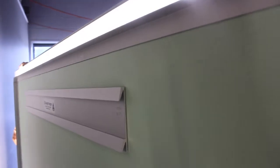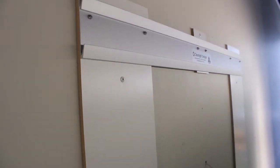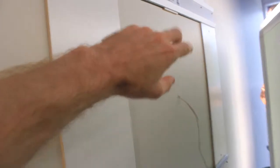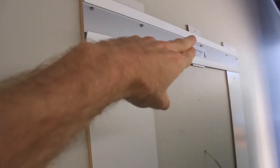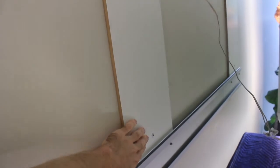This is what it looks like on the inside of the mirror. You've got your split battens — one at the top and one at the bottom — corresponding to split battens on the wall, one at the bottom and one at the top. The split battens on the mirror lock into place over the split battens on the wall. On the test wall here you'd normally have tiles; you just drill through the tiles and add the appropriate wall plugs with screws at each corner. The centre screw is for levelling out the split battens when you first screw it to the wall — drill and screw this one first, place a level on top of the split batten, level it out, and then screw the structure to the wall.